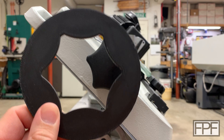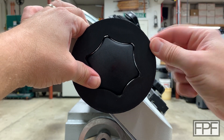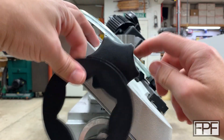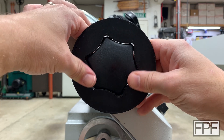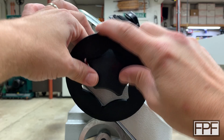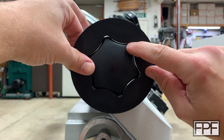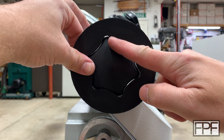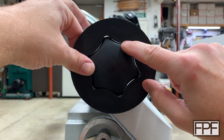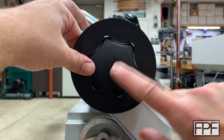Our first test piece is done — and it does not fit. Quickly eyeballing where the light's coming through, I think the biggest issue is that the tips of the star are too narrow. I just wasn't sure exactly how that was shaped and guessed from my desk, and that's not right. It's hitting out at the tips and it's also a little bit overall too big. I added two millimeters clearance and that was too much. I think I'm going to go with a slightly tighter diameter, and it looks like I want to arc in tighter rather than coming out to this point. I'll close up the clearances and make those adjustments.